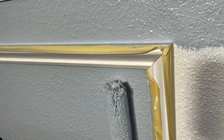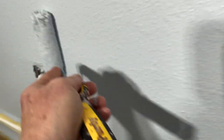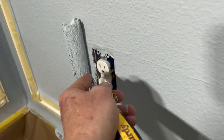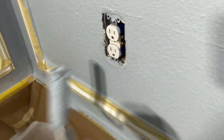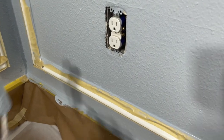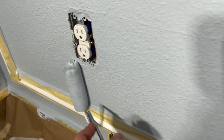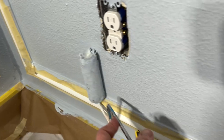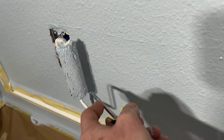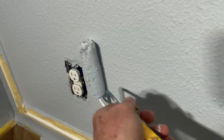in one stroke. See, I'm done with it there. Instead of doing it like this, look, then you keep constantly dealing with it. But if you start horizontally, folks, you know you have to finish horizontally in the same direction. So as you can see, I go right up to the tape and I pull my paint horizontally. And in the same direction. You don't see me going like this, going that way. I could do this, look. But I must finish in the same direction, okay? You want the whole surface to have a stippled effect.